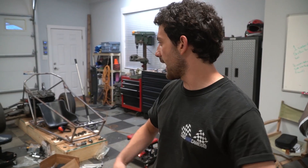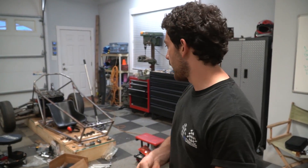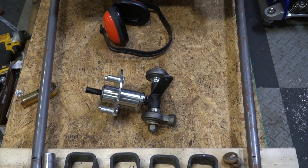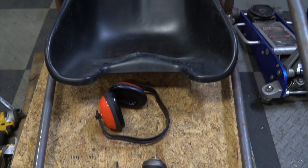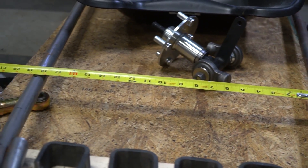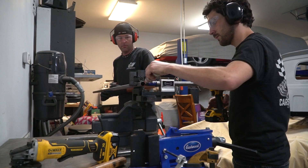We spent a few hours figuring out the design for the front suspension. We've already cut pipe, bent flat bar, and figured out what we're gonna use for hubs, spindles, and our pivoting pieces. It's not the most simple design, but independent suspension never is and it should work pretty well for us. We just need to notch some tubing, then we can show you the design and start building. We want to make sure it doesn't have any flaws right from the get-go, the main one being bump steer.